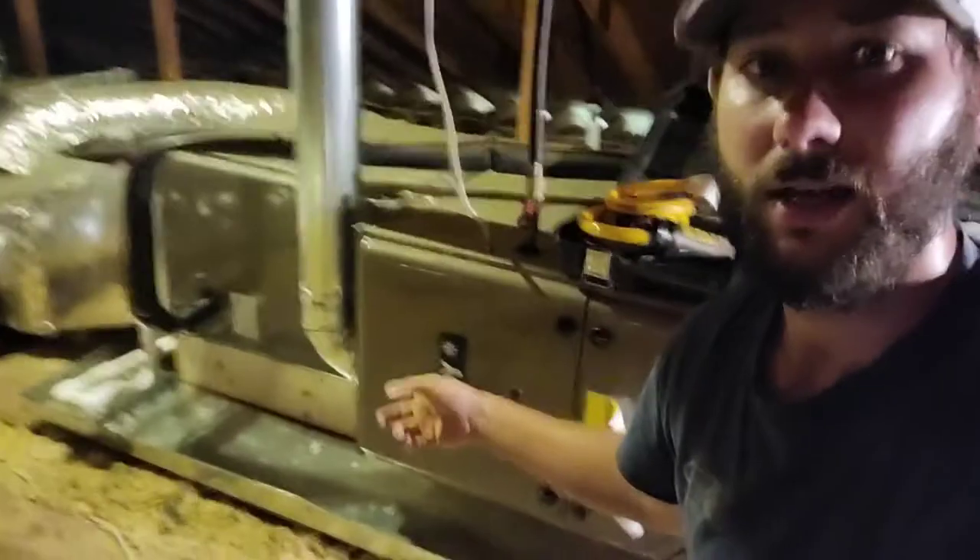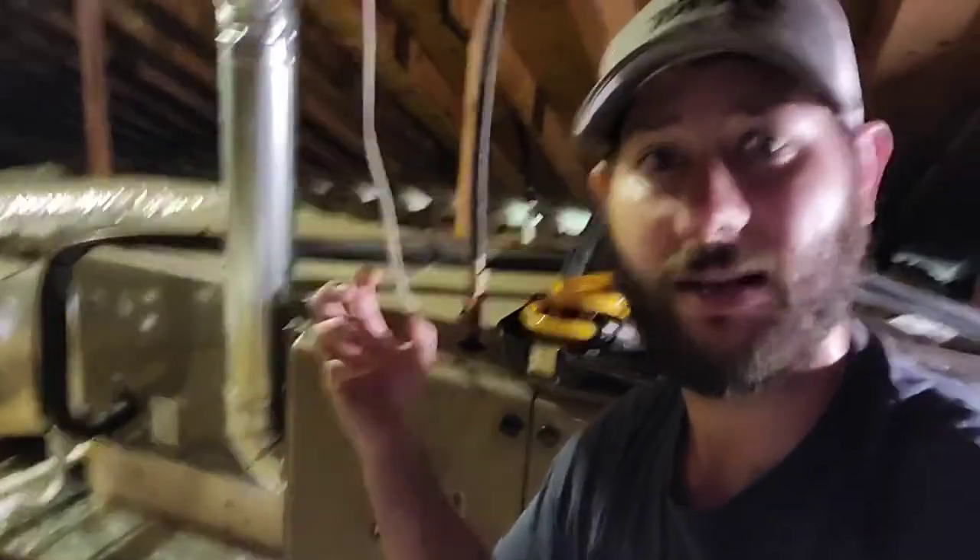What you find in the field is a drain stopped up because of lack of maintenance. Every year you should have your drain inspected to make sure it drains properly. If not, you could have a blockage due to sediment buildup in the pan from not having regular coil cleaning or maintenance done — and that's what happens over time: you get drain sediment inside your drain hose.